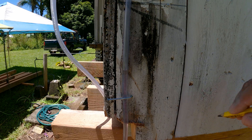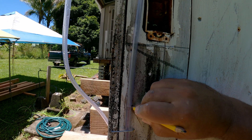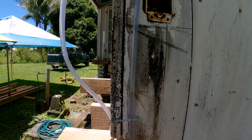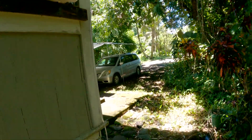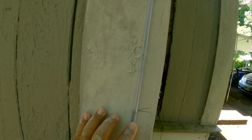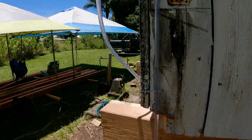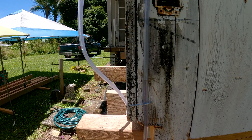The water has had some time to sit. I'll go ahead and make a pencil mark — that looks good. We'll head around to the other corner and get our mark on that side, then head to the opposite corner and see if anything has changed. Our water level still looks perfect.